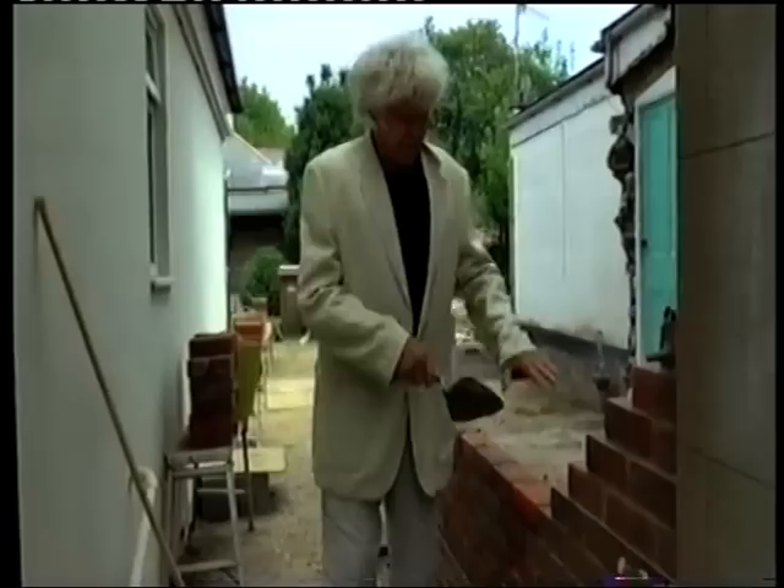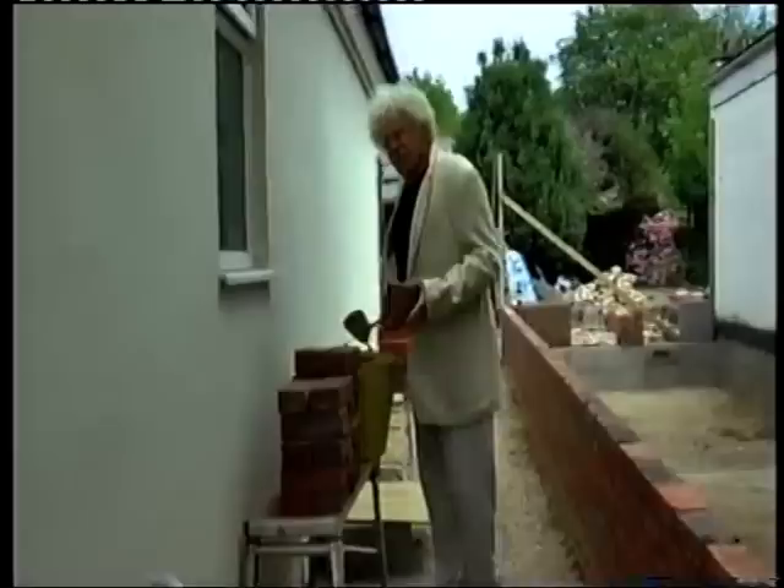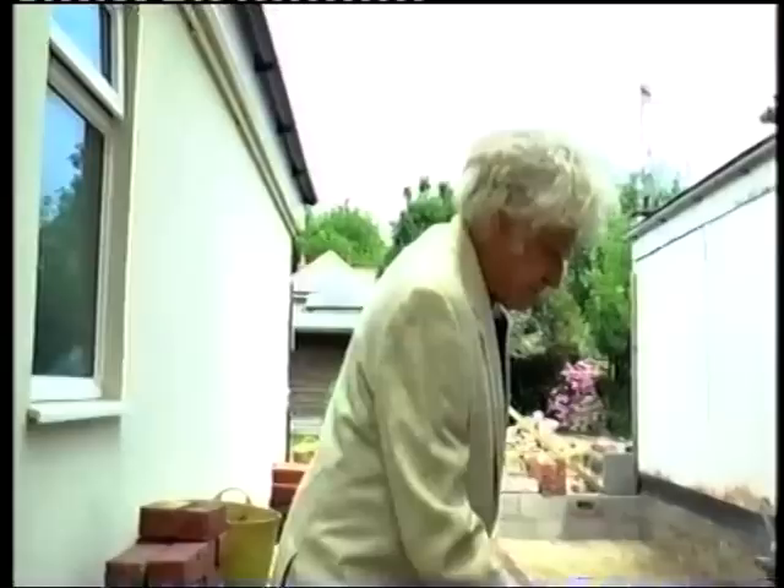...is spread the pug along the wall like they usually do. Sorry to all you bricklayers that do it, but it goes off, especially in the summer. You pick up one brick at a time - you just get enough pug for one brick.